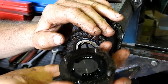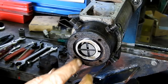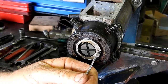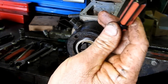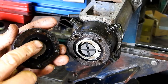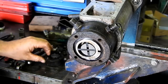Okay, so your valve body comes off. That's where your rotor, where your vanes run. There's an O-ring seal there. And these little fellas here, they're little vanes, vane pump. Now the vane pump, this also can turn in the housing. Oh, that's tight at the moment. So no need to force it. There's usually a little roll pin. Can you see that there? Yeah, there it is. There's a roll pin there, and that sits in the groove to hold this in the position that it should be.